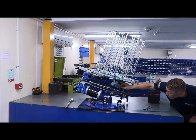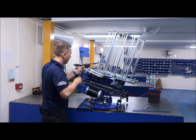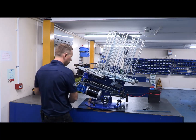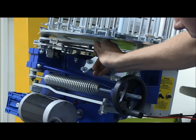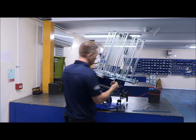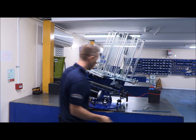Okay, now remember the inch, we want it going over centre an inch before the trigger. So push that there. It's just a bit too much, that one. Fire her off. Push her under. Again, we're looking for an inch before the trigger. Perfect. So now we've actually got that to where we want it. So we know we're going over centre an inch before the trigger, and now we'll take the roller switch in. And that then creates the gap that we're looking for on the main shaft and the drive bolt on the crank.